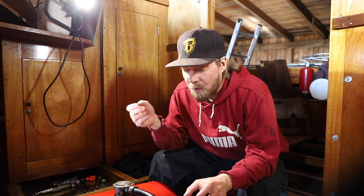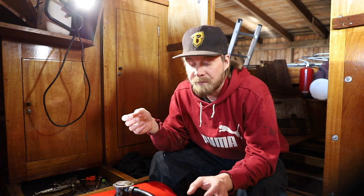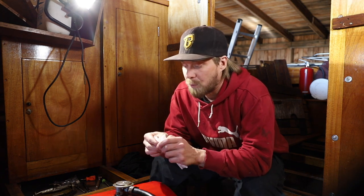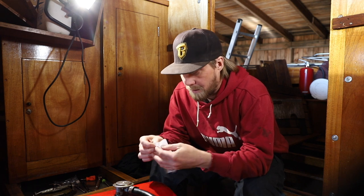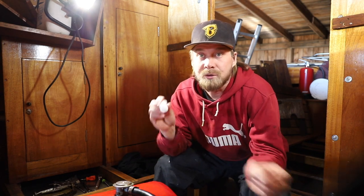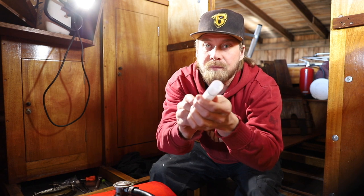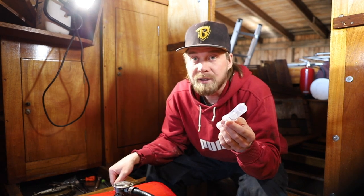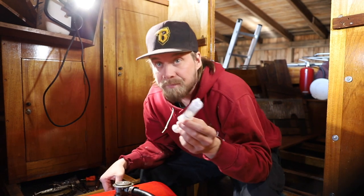So now I need to prime the first filter to get the air out of that, and before that I had to go to the local pharmacy and buy one of these injectors. And I'm gonna use this to get some fuel into the primary filter and maybe put some pressure to the system so that the air would come out until the secondary filters. But so, let's try this one.